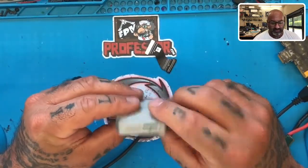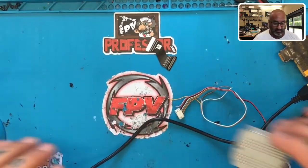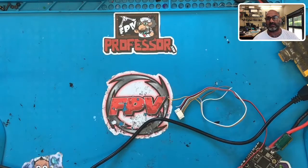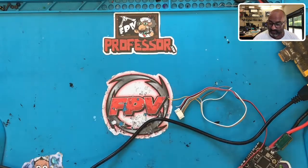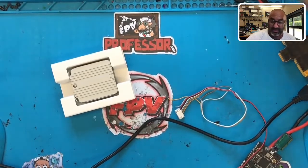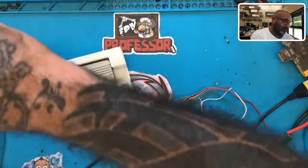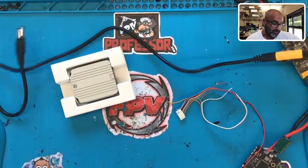I will put the cable under the microscope to see why there's an issue and get you guys an update. As far as the way it looks, when I get them back and they've got nicks in them and I'm told they've never been used, I can only do so much — there's a point where I have to defer it to DJI. But we're lucky we got this one working. Everything's good to go. If you guys have this problem, just check your cable first. Try to get another cable, see if you've got another air unit, take the cable out — don't assume the board's bad yet. Please subscribe to my channel. God bless, be safe, hope you enjoyed this video.